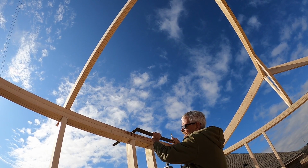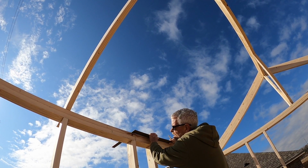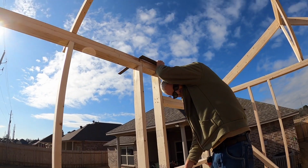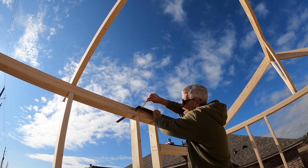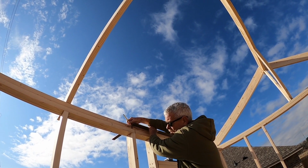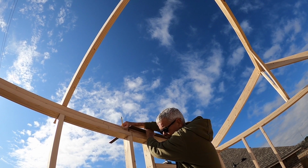You always stack everything, you know. These land on floor joists, see? Yeah. Rafters land on studs. Then everything bears the weight down on everything. Yeah. The foundation.